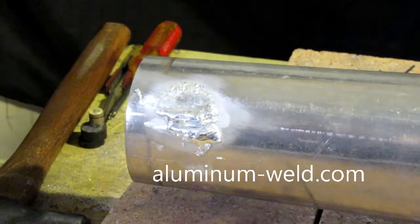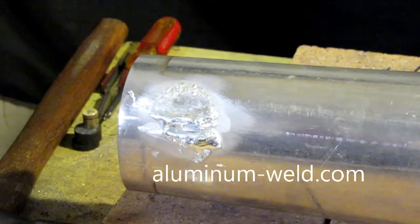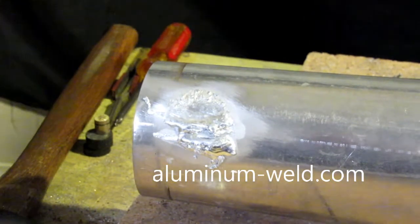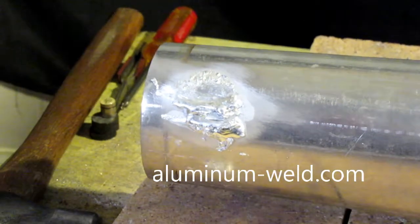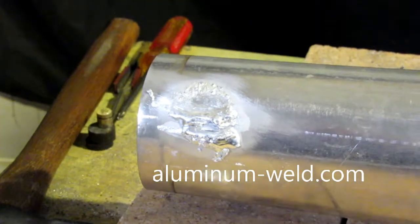Typically you're just looking at 100 psi max on your irrigation lines, and this will easily hold that because the rod is actually designed for air-conditioning refrigeration — at 600 to 700 pounds psi with a very small molecule. The refrigeration molecule is much smaller than water, so water is easy.